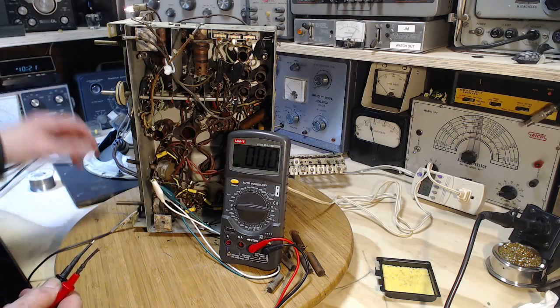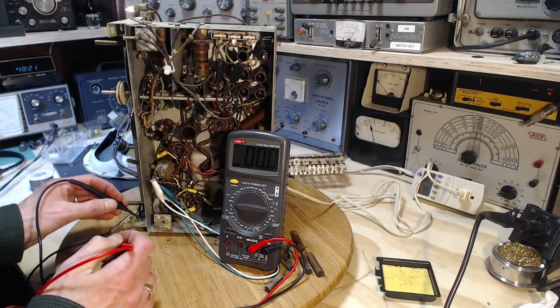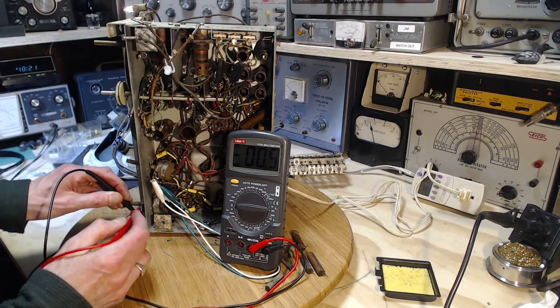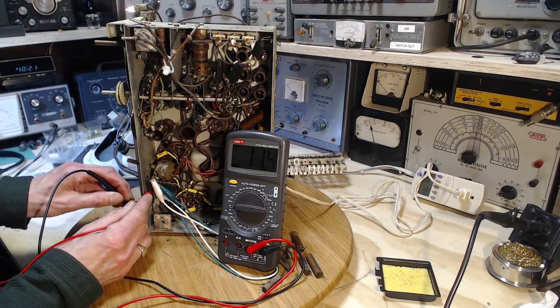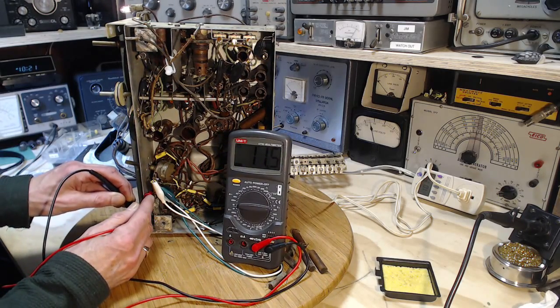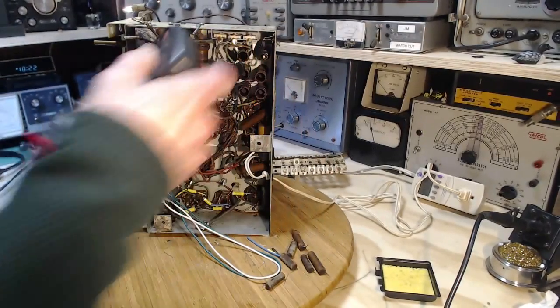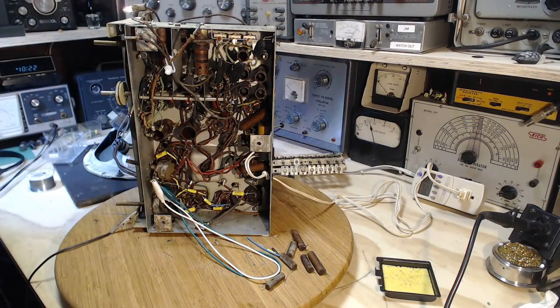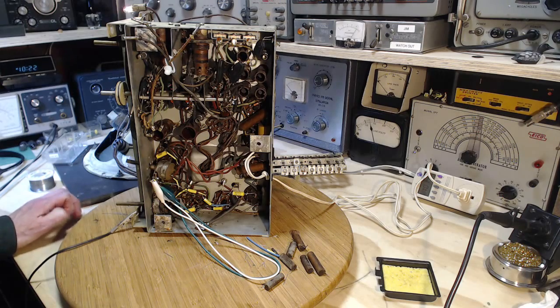You can hear the audio section producing that noise. Let's see. So I'll get it right off of here. See, 11 volts. That was 35 volts. 11 volts is right in the proper range, considering the low B plus right now. So, yeah, I think these tubes were in cutoff before from leaky, probably coupling capacitors, the two that I did there, probably blocking the B plus from reaching the grid of those output tubes, and that wasn't working.